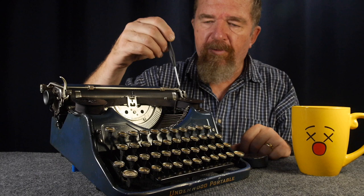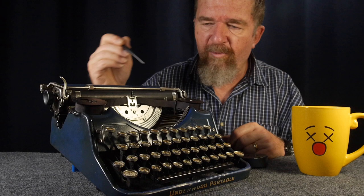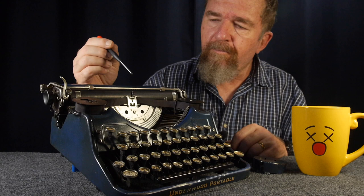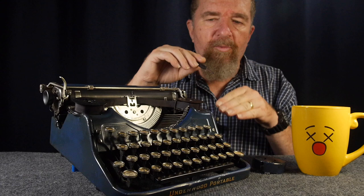One of the things that impresses me initially is the direction the ribbon spools turn — the ribbon comes off the front side of the reel instead of the back, giving it a more severe angle coming in toward the ribbon vibrator. It does have an automatic ribbon reversing system, which appears to be working fine. One of the only issues I initially had was that the tops of capital letters were being cut off — I thought it was an alignment issue with upper and lower case positions, but on a hunch I gave the ribbon more slack and the problem went away.